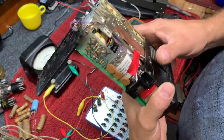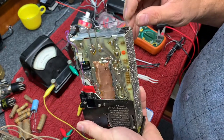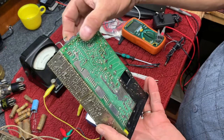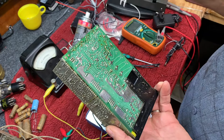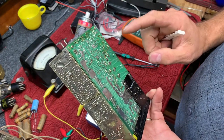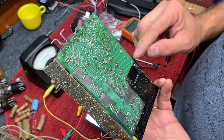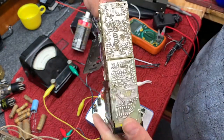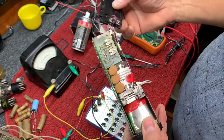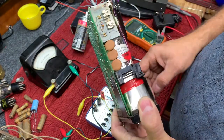I'm very pleased to see some of these boards are just completely clean — no corrosion — which is a really great sign this unit has not been overcharged or abused. We may find some pretty bad damage inside, but let's turn it around and get a feel for it. There is some corrosion on this board here, just a little. This is all the high voltage section. If the set has been powered in the last few minutes and you touch any of these, you'll get a pretty good jolt.